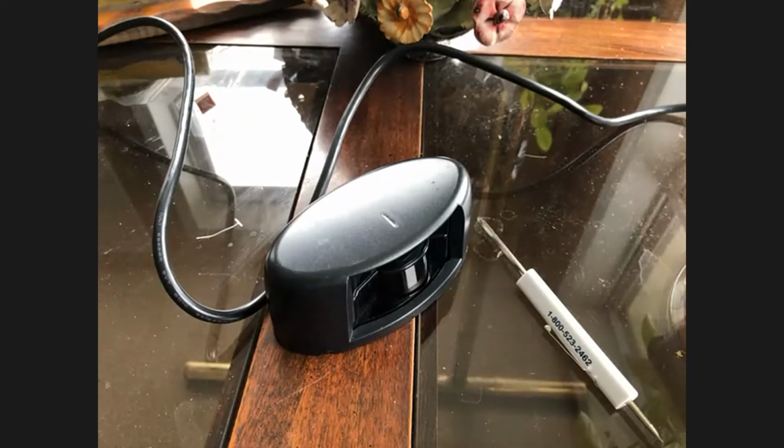But to know that, you really use these exact techniques that we're showing you. You can go to the display sensor, disp sense, in the third page of the hub, and you can see which sensor is constantly sending a signal. If it's just sending a signal, you can probably just conduct a teach-in and see if it's a problem sensor at that point, or if it has just been hit. There are lots of troubleshooting techniques to hone it down quite quickly.